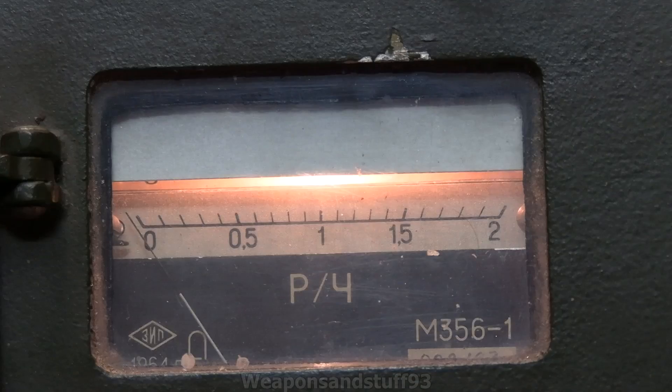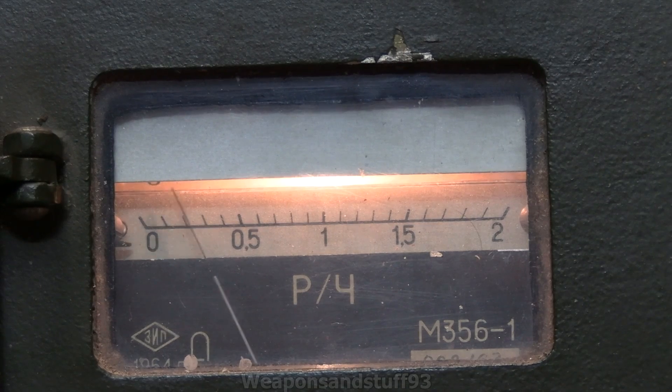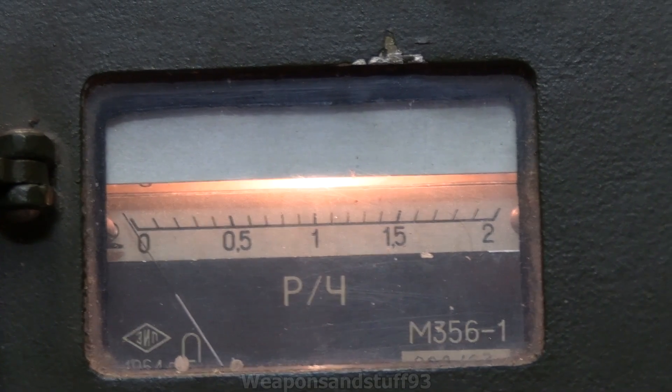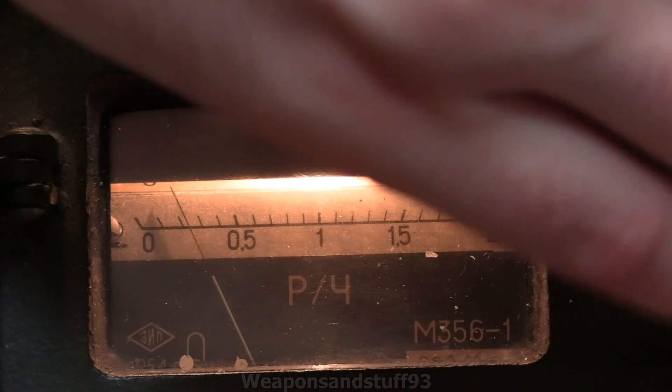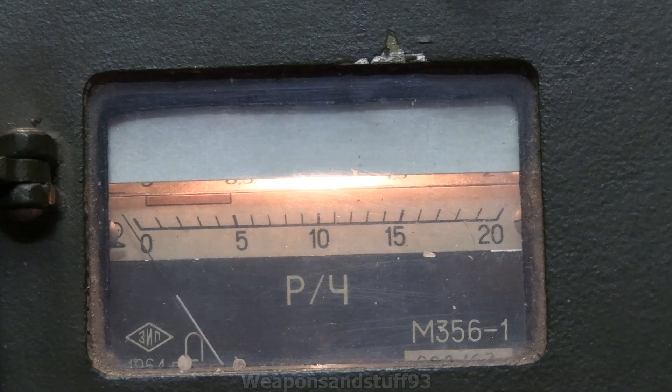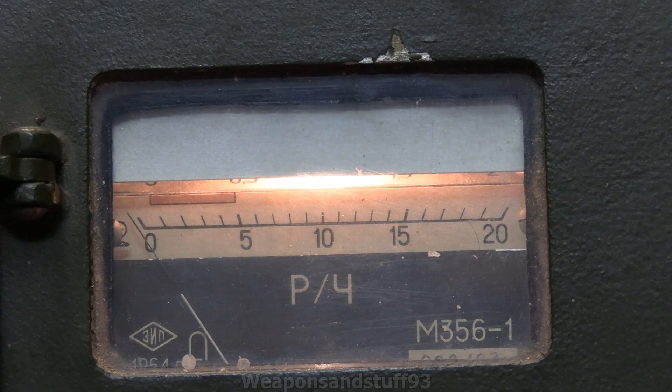So let's stimulate the chamber. I'm going to get behind the ionization chamber and bring the card with bits of AM241 stuck to it in front of the ionization chamber. The positive charge from the alpha particles floods the ionization chamber, and that maxes that out at two Roentgen. So what we're going to now do is turn this over to the next scale — we're now on the zero to 20 Roentgen per hour scale. I'm going to get my card of AM241 again and bring it close into the detector. Alpha is very short range, so I'm essentially poking it inside the detector. If I hold it outside the box it stays about 15 Roentgen; if I put it directly inside, it maxes out at 20 Roentgen.